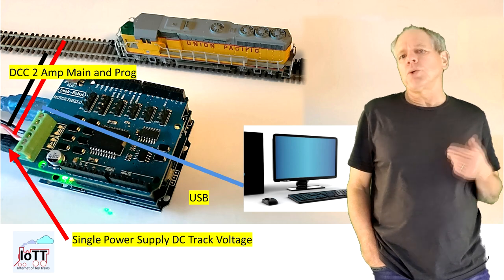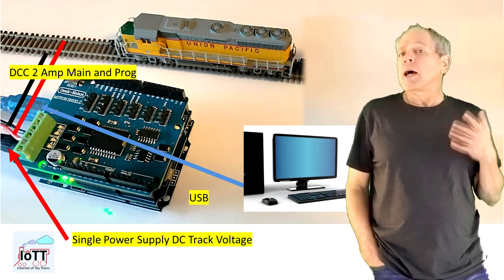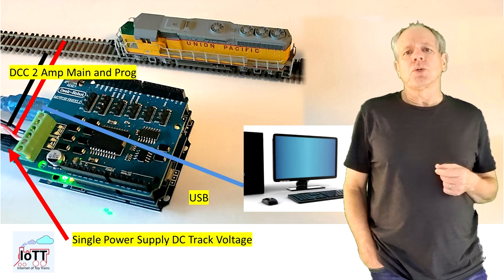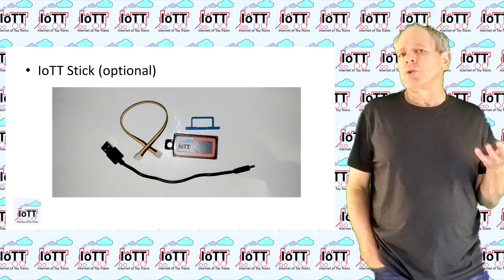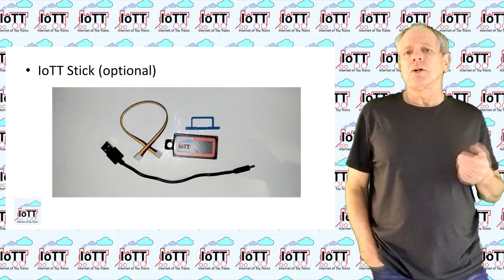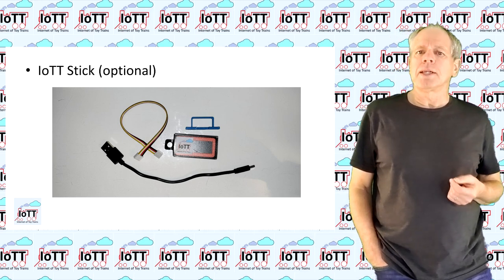With these components, you can build a simple command station with 2 amps track current, a programming track, and connection to a computer via USB that allows you to control the trains. If you want to have Wi-Fi access so you can use the smartphone and go without the computer, you can add an IoTT stick to the hardware list. I put some links for all the hardware components in the description below.